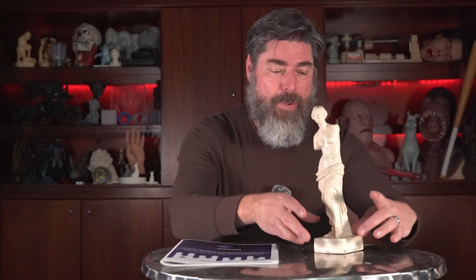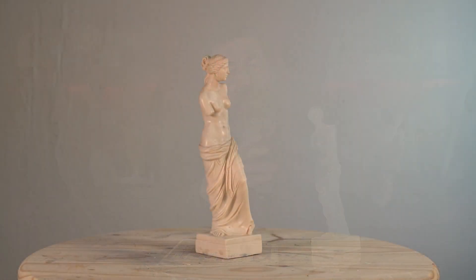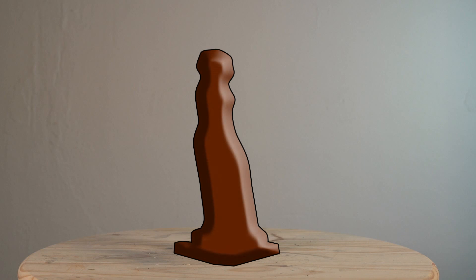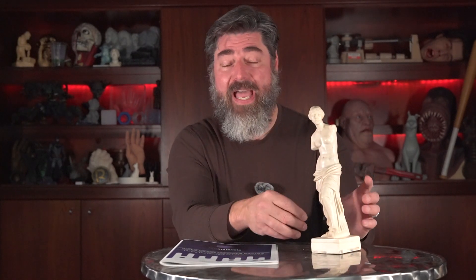The way this works is you're working in reverse. It's kind of the marriage of the best attributes of both a brush-on mold and a poured block mold. You take your master, make sure it's secured to a baseboard, and then clay it up in exactly the way you want the silicone to be formed later on. Instead of brushing on silicone, you take clay — either rolled out in slabs or heated and brushed on. Typically I put saran wrap over my original piece to protect it, then build a clay shape of the mold over my part. That allows me to sculpt key ways into it, whatever I need to do to make it exactly the way I want.